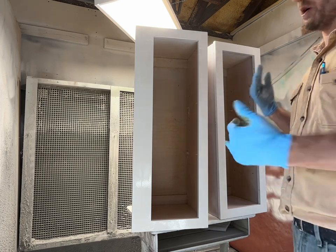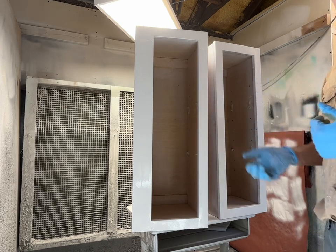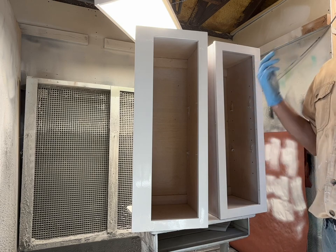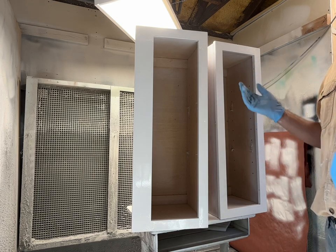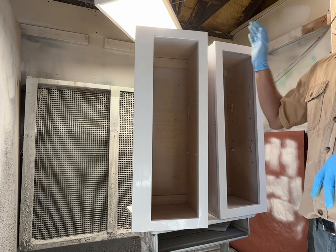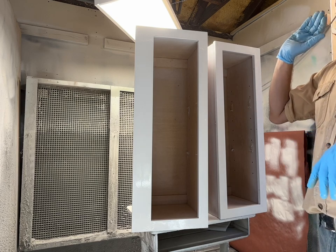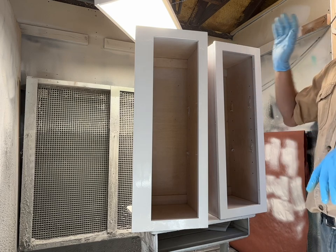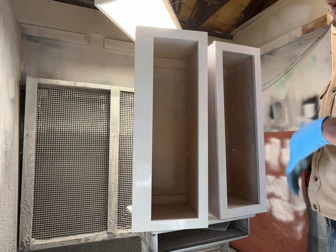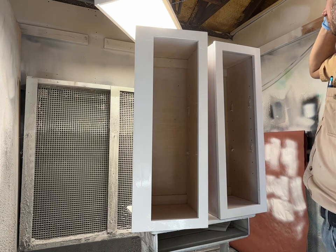I'm talking about when I was at my job site, I kept putting it on pretty heavy because I wanted to fill the grain. If I could do it in 1 or 2 coats, great. I ended up doing 3 coats, and in all 3 coats, even at 4 to 5 wet mils, I did have some spots, probably because it was a little heavier than that in some spots. It seems like when you hit about the 10 to 12 mark, probably where your overlaps are, you're going to start seeing this. It doesn't happen right away. It happens sometimes in a couple minutes or with a little time.